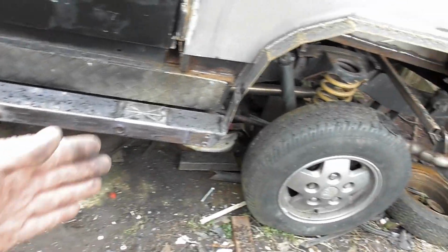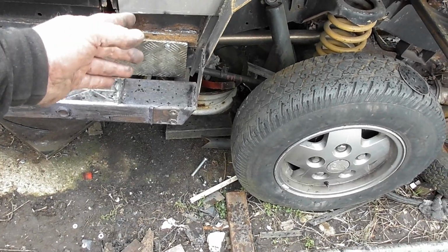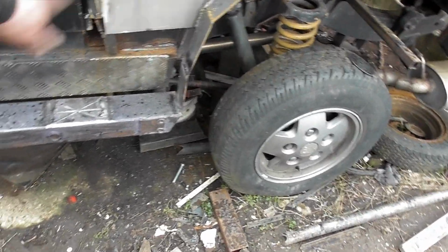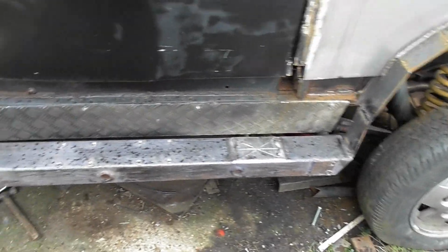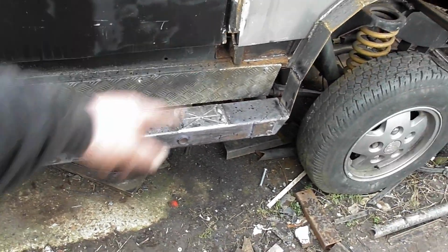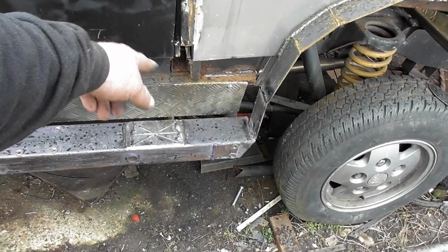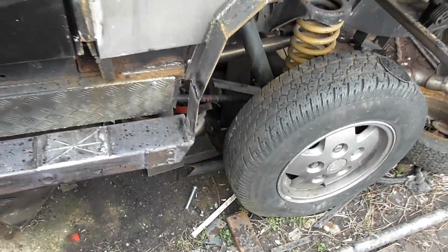Although on this side, before I get anywhere into this, tomorrow, if it's not raining, we're going to start doing all of that lot. We'll get the piece of stainless cut and welded in down there. It'll work. Piece of steel, plasma cut across, put a new piece of steel in there, cut out that box steel altogether, and then we'll try and cut a piece to go along the bottom of that door to seal that all up. Weld that piece of box steel down there that isn't connected yet. Oh, and there's another piece to be welded up in here as well, to stop all the muck from getting in.